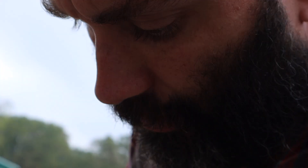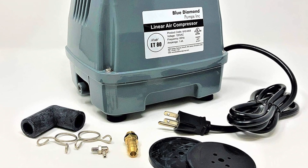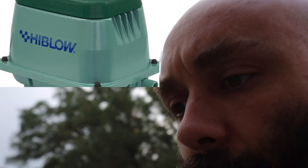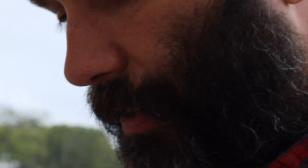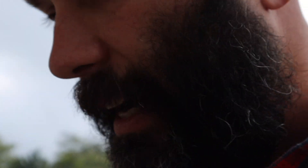Today we're going to be replacing this Blue Diamond ET80 linear air compressor with this other air pump from Hiblow — it's a Hiblow 80. We're going to be replacing one with the other today. I've got a hardwired connection on the old one, and you can see the new one will have a plug. So we're going to have to cut that, hardwire it in, and replace the flexible valve.